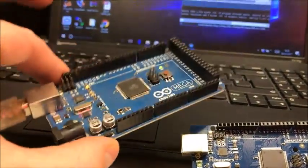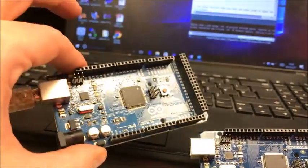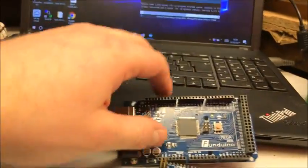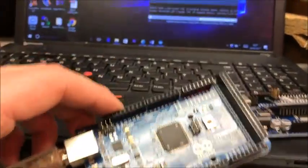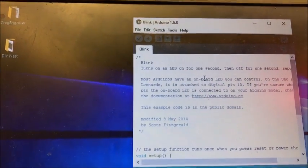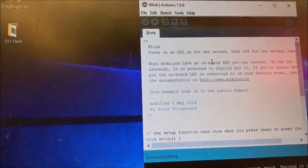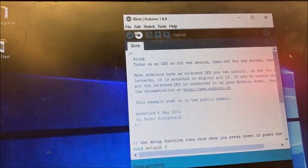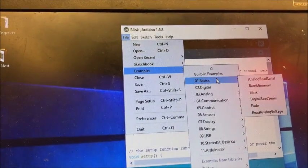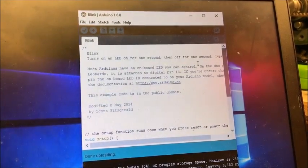The next stage we're going to move onto the Arduino. If you are familiar with this, please by all means skip past it, but for a complete tutorial I'm going to run through this in case anybody's wanting to build this project with no experience of the Arduino. What we need to do first is download the Arduino software — it can be downloaded for free. Then open up an example called Blink: go to File, Examples, then Basic, then Blink.